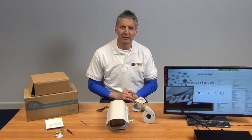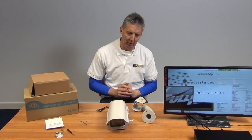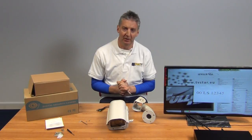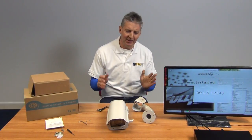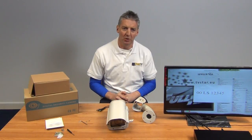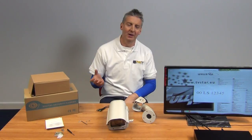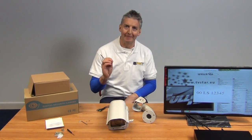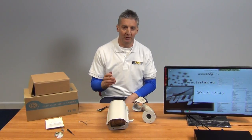I'm going to give an overview of a 25 meter white light NPR box camera. This has a resolution of 700 TVL, and NPR stands for number plate recognition. It is ideally used where you want white light rather than infrared to give very clear night time readings of reg plates on cars — which is obviously a very important thing.